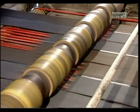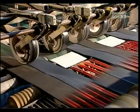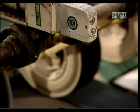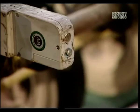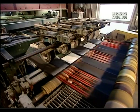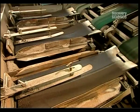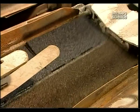The cutting machine chops both size and profile. Standard shingles measure 100 by 33 centimetres. This model has a straight edge, but some styles have a curved bottom. An automatic counter keeps track of production. The shingles are automatically stacked for packaging — usually 21 sheets to a bundle, enough to cover roughly 3 square metres of roof.